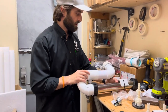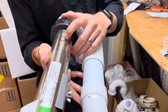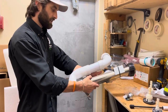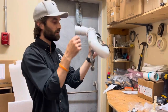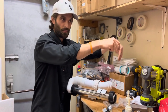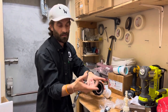So how you convert: somewhere on your heater tube you'll always find a little cap — it could be plastic or metal. When you're standing in front of your unit — box, pump — it will always be on the left side of the heater tube, under the plumbing doing the S-curve. To convert, if your hot tub is full, close both knife valves — the plumbing between the pump and the tub, and the plumbing between the heater tube and the tub.